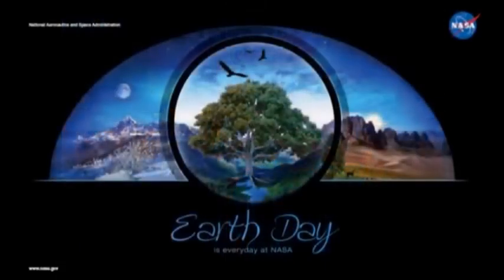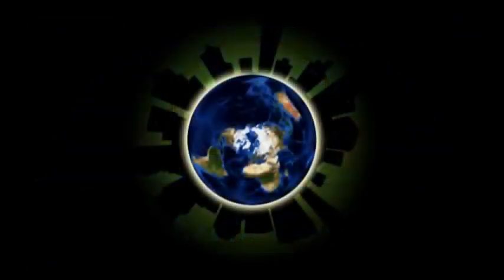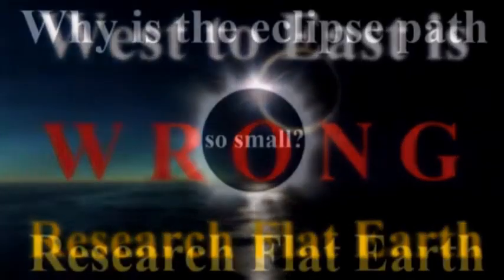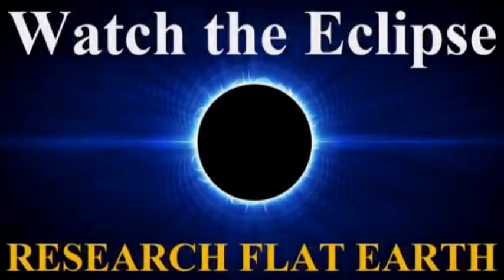And these are moving part O-rings. These things would need to be replaced all the time. I could throw out a number, but it would be a guesstimate, but probably every 2 to 3 weeks if you're opening and closing it a lot. 2 to 3 weeks? Depending on how much they opened and closed it. Wow. And that's even considering those tiny little O-rings would hold up to that high a vacuum, which I'm telling you, there's no way you're going to have an O-ring that is dynamic that's going to hold at that vacuum. You have to compress that O-ring pretty solid to keep it from losing vacuum.